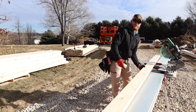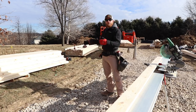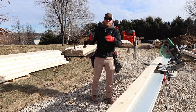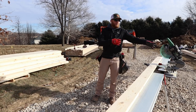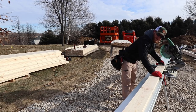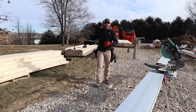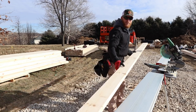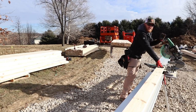One of the major disadvantages of the CutHub versus cutting off a lumber pile is that with a pile, everything is right there — you're just pulling your tape, marking it, and cutting everything right there. For us, we still have to move the pile of lumber by hand. Really all I'm doing is skipping the steps of pulling my tape measure, marking it, putting a square line on it, cutting it, then sliding it to a different pile. But the important thing is every cut is accurate with a clean end, and the lowest person on the totem pole without a lot of skill can do this exact job.